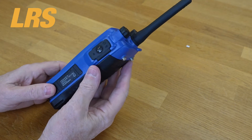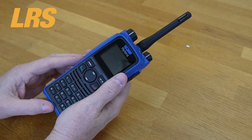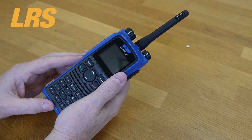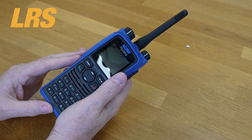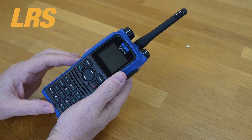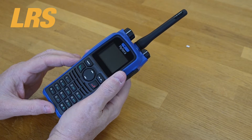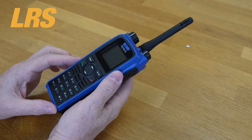There's a scanning facility and automatic cell reselection or roaming for IP multi-site systems. Secure encryption is available with encryption algorithm ARC4 at 40-bit, in accordance with DMRA, or with optional algorithms AES-128 and AES-256 — that's 128 and 256-bit encoding.